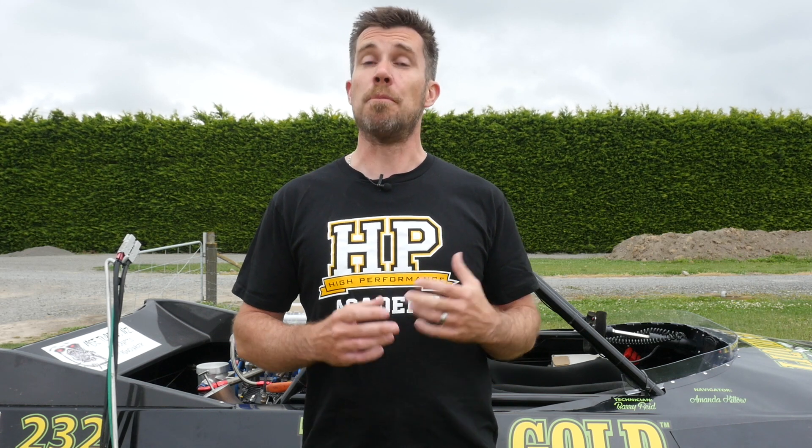It's still at 5.6 litres but it's now sporting a set of high compression forged pistons, much stronger conrods, a much stronger billet crankshaft, and it's also dry sumped. The dry sumping is essential because these boats can pull over 6g in a corner, so the dry sump is critical to make sure that lubricating oil still reaches all of those critical parts with such high cornering forces.